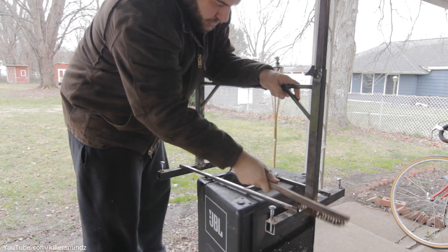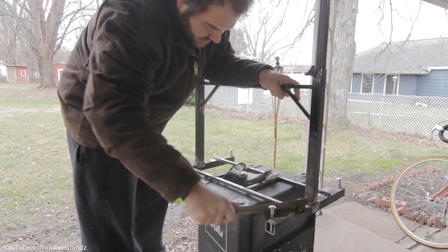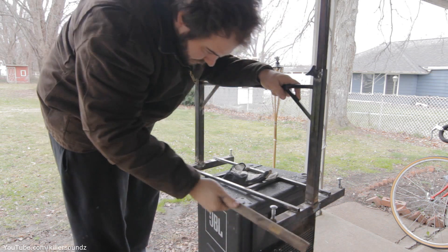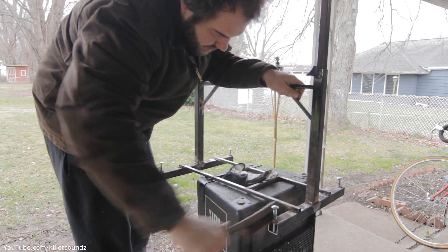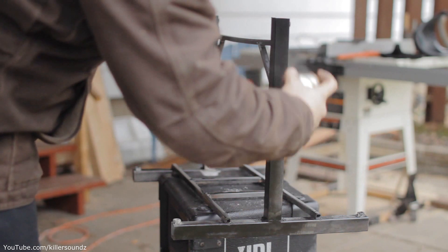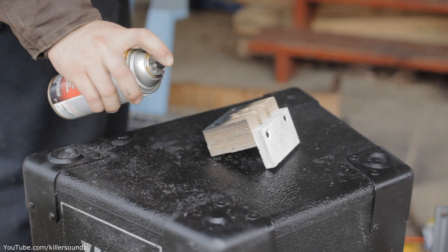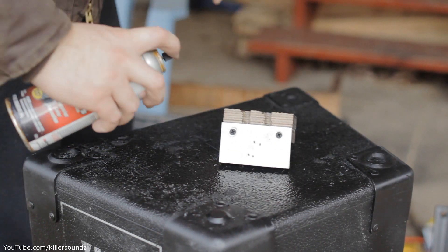For the feet, I did pretty much the same thing — welded some nuts into the bottom legs and put some carriage bolts through them; those are 3/8 inch. Here I'm also just cleaning off the weld gunk, because when you use flux core it leaves a bunch of residue. I just wire brush it off, then I'm going to put some paint on it. This is also a good time to throw some paint on some of the other components of the slider.